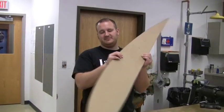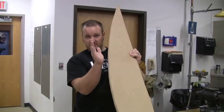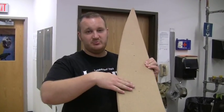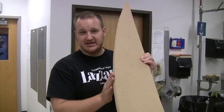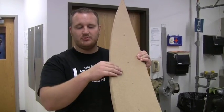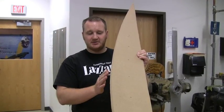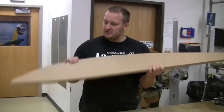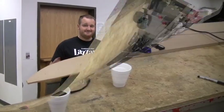Then what we're going to do is use a sander to sand right up to the line, but instead of sanding it 90 degrees to the surface, it's not going to be a nice straight corner — it's actually going to be angled in. And what that's going to let us do is use these forms to bend aluminum around them to make our ribs. If it's just 90 degrees, aluminum always wants to spring back a little bit, so we'll actually bend it to about 95 degrees, and then when it springs back, we'll be right at that nice clean 90. We've got our first one rough cut out, we'll touch it up and then start sanding.